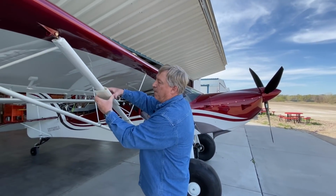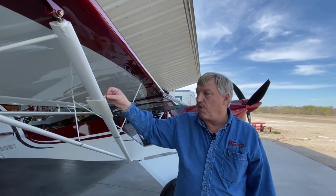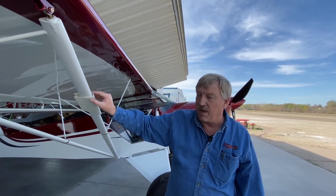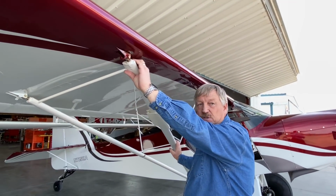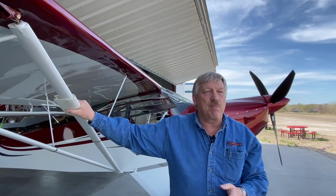You would take it and wrap it around your 1-inch tube, snap it, and then of course you'd bond it to that 1-inch tube. All the ribs that are here that are molding lines, you want to sand out, clean up, and make nice and smooth. Do all your shaping down at the root section and up here at the top where your wing is, bodywork them, paint them, do all that. It works great, probably 30 to 40 hours' worth of labor at a minimum.